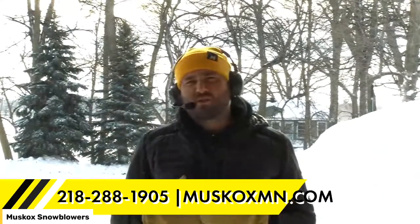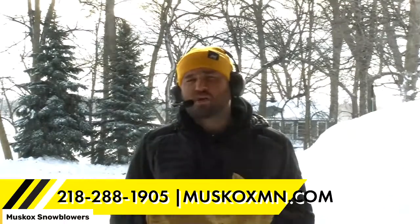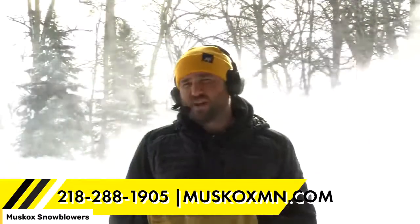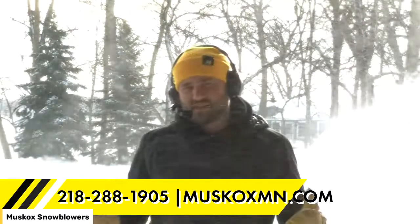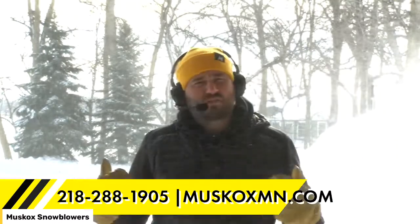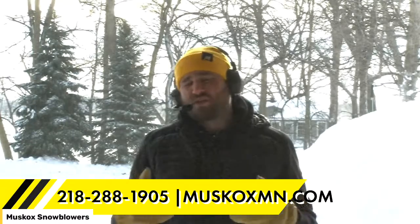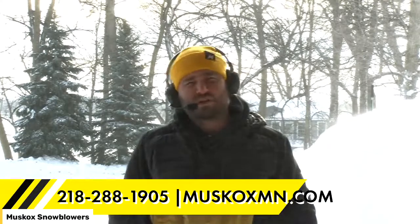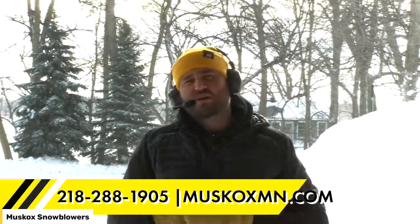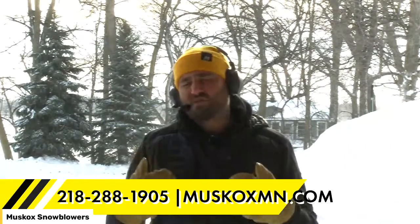The best thing we get an opportunity to do is talk to you guys and find if we're a fit for your operation. Our machine does work on low, standard, and high flow machines. Super common question, 17 gallons to 45 gallons per minute. And we work with all brands of skid steers, including Bobcat tool cats with the single arm. Reach out to us, and we have different references of basically every brand that's currently using a MUSKOX snowblower, and basically every application you can think of from Alaska to Maine. Today we are showing off our MUSKOX 2278 with a John Deere that we have from RDO Equipment. That's a high flow machine that we're running, but again, it runs anything from 17 to 45 gallons a minute.